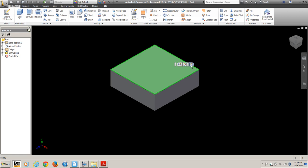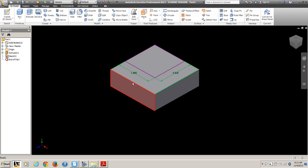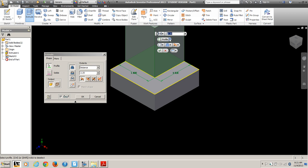I'm going to select a new face. Let's do a new rectangle on that face. Again, make sure that corner turns green. 1.5 by 1.5. You'll notice that's all purple — it's fully constrained. And now we want to do a cut extrusion.